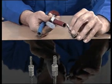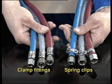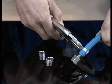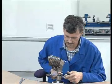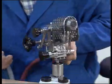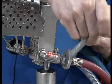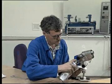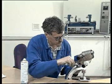Insert the glands into the corresponding hoses and connect them firmly. This can be done either with hose clamp fittings or spring clips. Another possibility is to use pinch clips which can be pressed together with pliers. The media connections on the burner are color-coded in line with the medium and labeled accordingly. Screw the union nuts onto the thread and tighten them with a suitable tool. Using a leak indicator spray, check the tightness of the media lines and the connections. If necessary, tighten the union nuts.